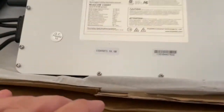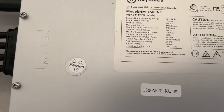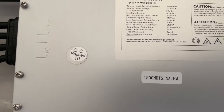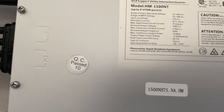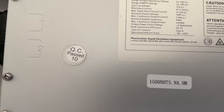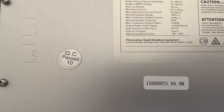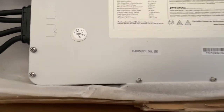Those are real MC4 connectors. That is the HM1500. It's four MPPT inputs for four solar panels. Your MPPT range on here is 16 to 48 with an operating range of 16 to 60 volts DC, output current of 5.99 amps AC. It's one of the highest power microinverters available.